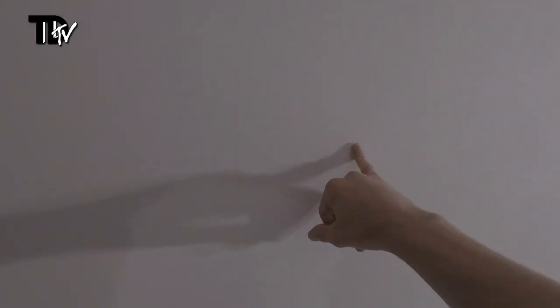So today we are working on a rental property, just painting the walls and woodwork. On the walls we're going to be using Isomat Colour Economy, which is a contract matte emulsion. As you can see, this area is very white over a lilac colour. The lower section below the coving has just been brushed and it's yet to dry — it's almost slightly translucent looking, it doesn't look like it's been done at all. But once it's dried it really bleaches out nicely and gives you full coverage, and that's just after one coat. So we're going to be putting two coats on today.